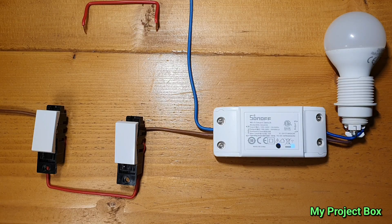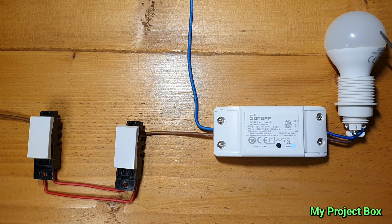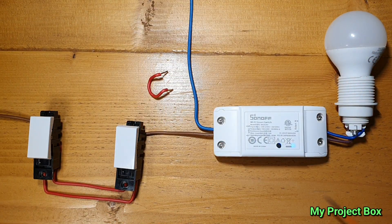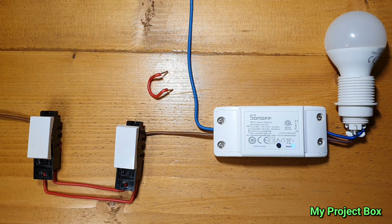So much potential for this magic switch — I'm sure we'll see more of this in the future. And then I literally had a light bulb moment: what I would like to see is this magic switch mode be put into a smart bulb. That way, you can just put a smart bulb into any light fixture, put a little wire link behind one of your switches, and you can have one-way and two-way lighting that works with light switches just out of the box. The light switch won't turn the bulb off — it's super clever. This is really something that will be handy to see inside a smart bulb in the future. The magic switch function seems to only work with the original Sonoff firmware, but I believe some clever people have made a Tasmota firmware that can now use the magic switch functionality as well. If you'd like to try the Basic R4 for yourself, there is a link in the description and you can use my coupon code to get a discount.